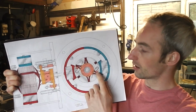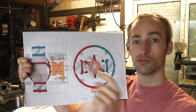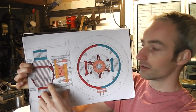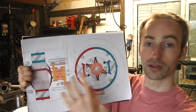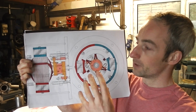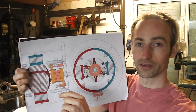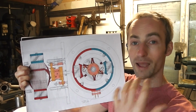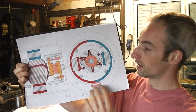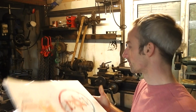So we've got these monstrous 95 kilo neodymium magnets side to side to try and give it enough power to run the motor at the other end. Also, another interesting fact, the laminates here and the commutator or the slip rings, they're all big and theatrical. Again, this all makes it less efficient. But we want these things to be theatrical, big, oversized, so you can point to them and say, that's what that does, that's how it works, and that's how it relates back to what you see in the textbook. That's what this is all about. It's about big visual stuff. Yes, again, all standard, everything fits to everything else.